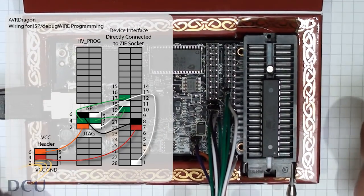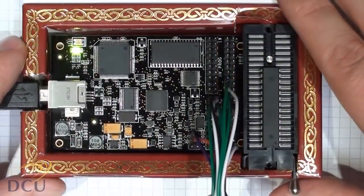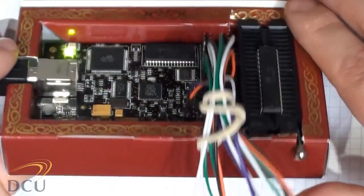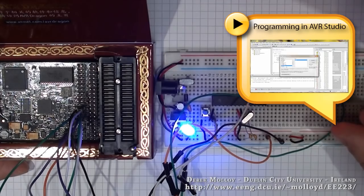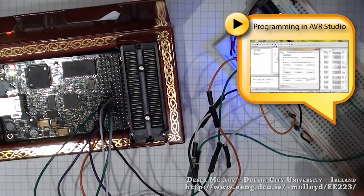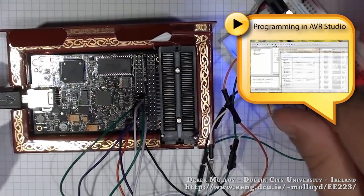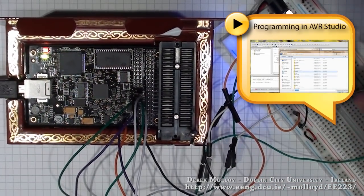So that's an example of the physical setup and wiring of the AVR Dragon, of using it to program an ATmega IC. In the next video, which you can follow at this link, I'm going to discuss in some detail how you can write an application using AVR Studio 4 and how you can use debug wire mode to step through an application and see exactly what's happening within the IC.